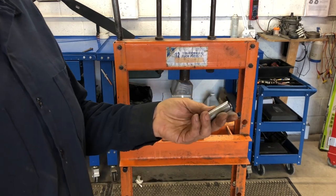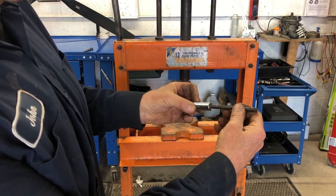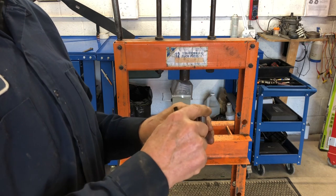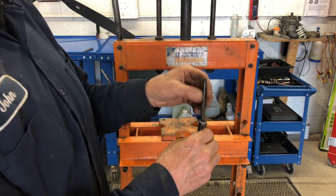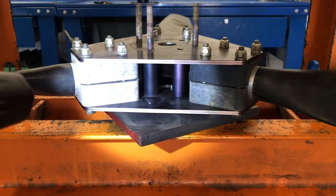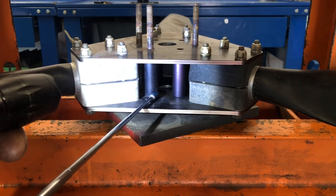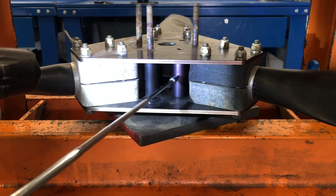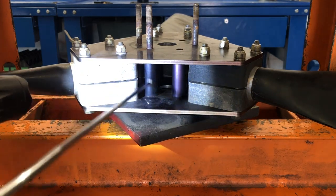So here's my plan. I'm taking this 13 mil socket — one of the ones I talked about before, I call them the cheapy one. The nut or the head of the bolt will go in and then it slides way in. This is what I want. So I'm going to use this to support directly beside the head of the bolt on that pressure plate, the aluminum plate. And then hopefully I can get it in the press to start to move in, then I'll reset with something of a bigger diameter. In between these two plates there are spacers, sleeves, whatever you'd like to call them. I'd like to just heat this up and expand it, but this is composite. So is the tip of the blade that's in here, so can't do that either. The only way to do this, in my mind, is just to press it through.